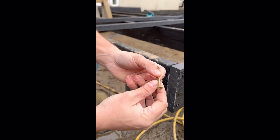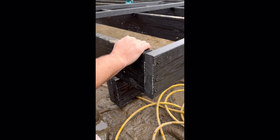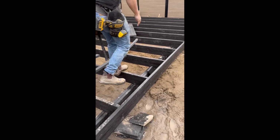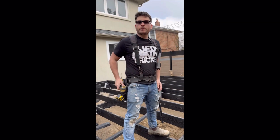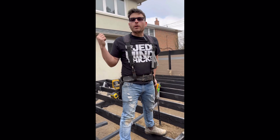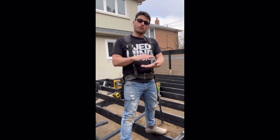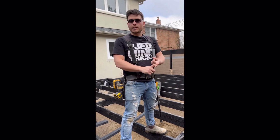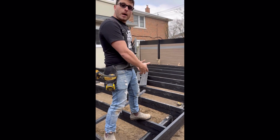We're framing the entire structure out of these 3 1/8-inch framing screws. And look at this. 24 inches on center for our joists. I know that typically, composite decking gets 12 inches on center because most of it is garbage. We're using Owens Corning wear deck decking, and that allows us to go, because of the fiberglass structural integrity that it has, 24 inches on center, which means we're using less material and we're framing faster, which means we can invest those savings into a better frame.